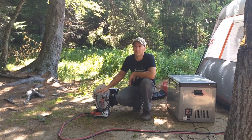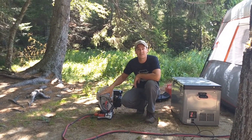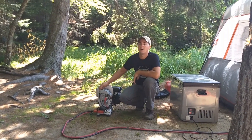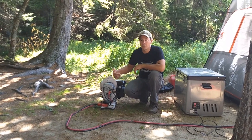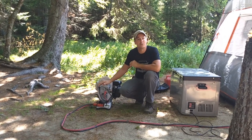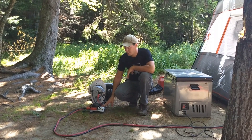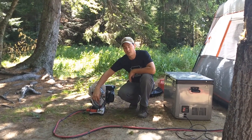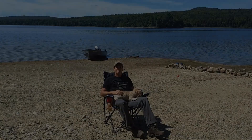On my Affordable DC Generator I've got an off-the-shelf one-wire AC Delco 12SI alternator. These run about $70 to $80 and are available on Amazon Prime or pretty much anywhere. All they need is a positive and negative connection — as my kit provides. It charges at about 14.5 volts and is great for bulk charging: start the engine, blip the throttle to get it charging, and you get a constant output. For more control over output voltage — for different battery types or to get into a float mode rather than just bulk charging — I'm also testing a Sterling Power alternator regulator, which runs about $180 to $200. It connects directly to the lugs on the generator, and I've done modifications so I can run either the Sterling Power voltage regulator or disconnect it and use the built-in one-wire regulator.